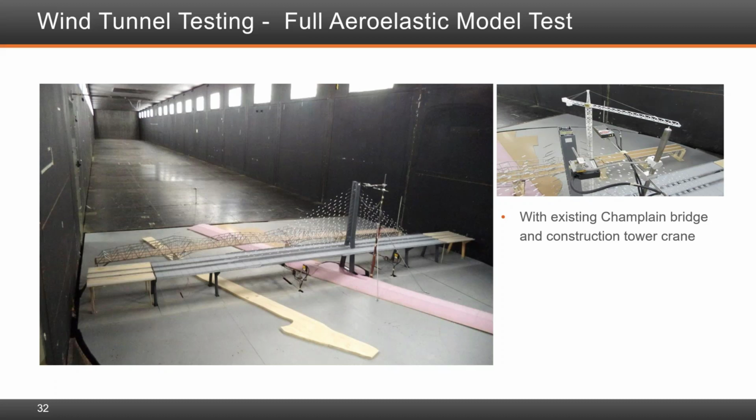to avoid having that particular step be on the critical path. But to give the audience a sense, in some of the stays, we had up to 7 steps of stressing as we went in. It was a very fine-tuned machine so that we can achieve no overstress of the stays and no overstress of the girders. Okay, let's look at slide 22 real quick on the cable stay bridge.